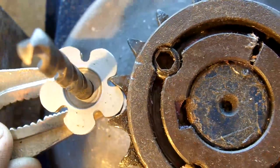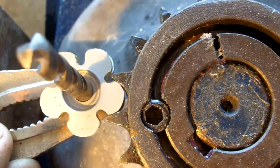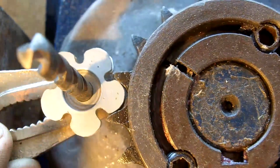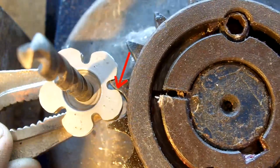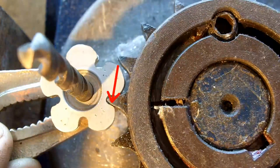Remember, the cog on the right has been designed specifically for use with a chain, whereas I've designed the little gear to be used with this cog. I'll slow this down so you can take a good look. Note the point of contact from the gear on the right to the top of the gear on the left. It might look straightforward, but if you take a close look here, you'll see that I've profiled the gear such that when the cog on the right goes in the other direction, there is no backlash between the two gears.